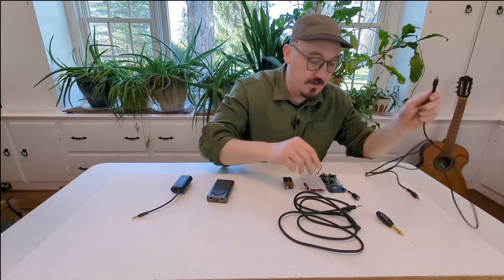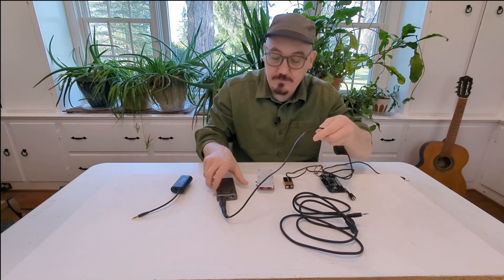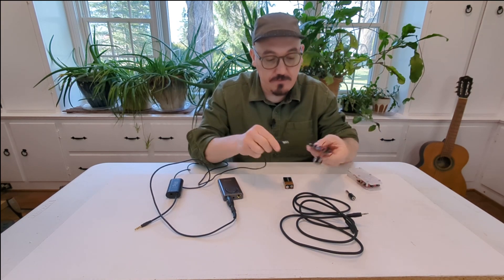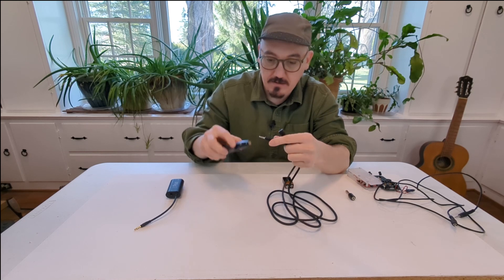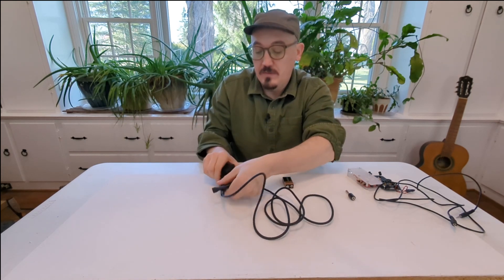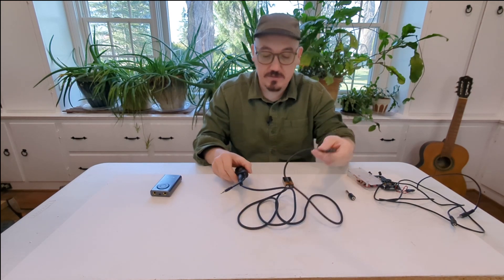So basically your setup is like this: you need an audio-out cable — like a headphone jack cable — plug it into this adapter, and then you're going to go into your guitar pedal, and then you plug in your electromagnetic wave sniffer. Or with this one, you just plug it into the headphone jack similarly. Or if you have this simple circuit, all you need to do is go directly from these two inductive elements to here, and then this either goes to your headphones, your guitar amplifier, or to your phone via an app. You can get a USB-C adapter, or there are newer versions of these devices with a USB-C connection. We'll get the sounds going and see how these three different options sound, and I'll put links to these devices in the description below.